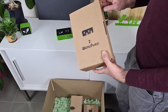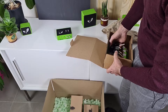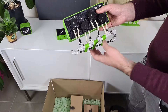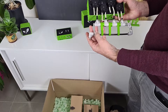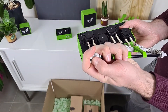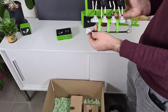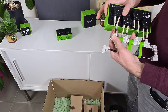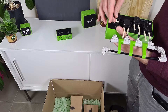Now the second one is the water pump — your dosing module. This dosing module comes pre-equipped, already equipped with its harness. This water pump has four dosing pumps. The harness is equipped with air and water pneumatic connectors that you can easily push to release or connect a tube — those are six millimeter outside diameter tubes. And we've made it so that it's easy to intervene on the pump itself. For example, if you want to check your pump head to clean all the tubes, you can release by pressing here and pulling the tube.